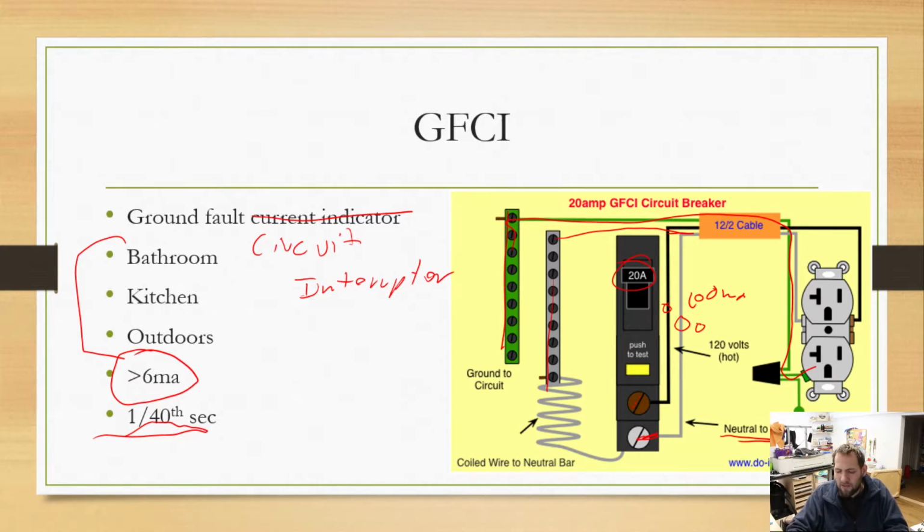But yeah, so GFCIs, and again, you may see them. Normally, if they're outlets, they're like a square type of outlet, and they have two buttons right here. And then again, you have your outlets over them. Those buttons are right in the middle. And the nice thing about GFCIs is what it says right here: push to test. All right, there is actually a resistor built into either the outlet or the circuit breaker, which just takes the black wire when you push that button. So the black wire comes into that button, that wire comes up, goes through a resistor to ground, which say allows 10 milliamps of power to flow. And this will then realize it, and it will then purposely pop the breaker, or pop your outlet. So you can actually test them to make sure they're still good, which is something that you should do at least on a yearly basis, if not more often.